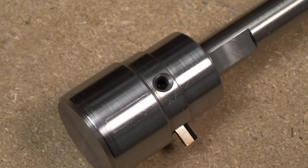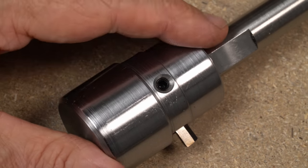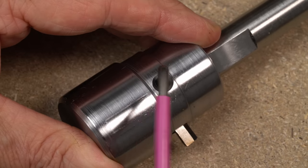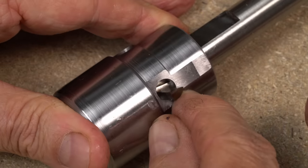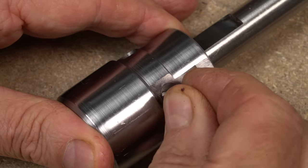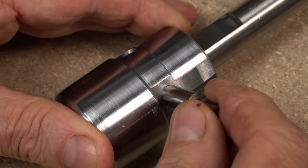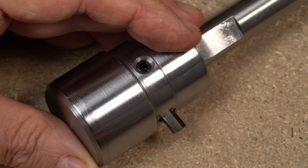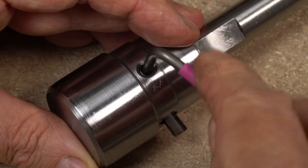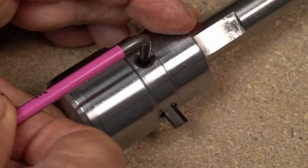I'm making the head of the tool from EN8 steel bar. It machines well and I don't need to harden it as it's only going to be running inside a PTFE or other slippery plastic bore. The cutting tool's a simple manual grind with reliefs and a 5-degree rake angle. It's ground from 8mm round cobalt high-speed steel. I plan to lock it in place with an M6 set screw, or grub screw if you prefer.